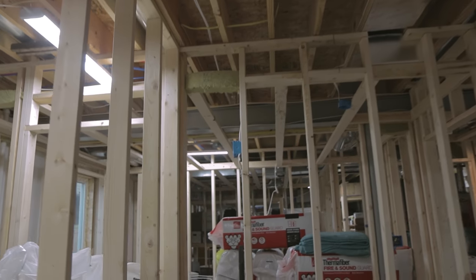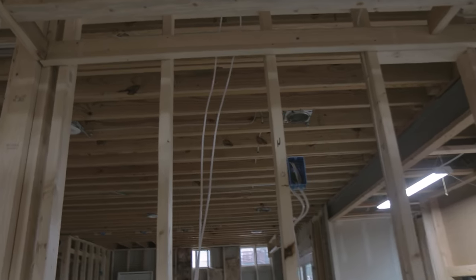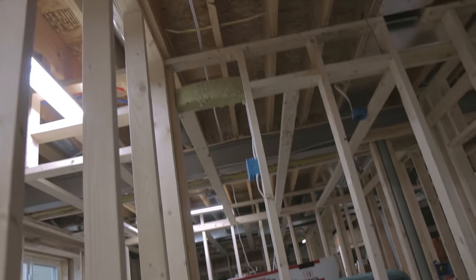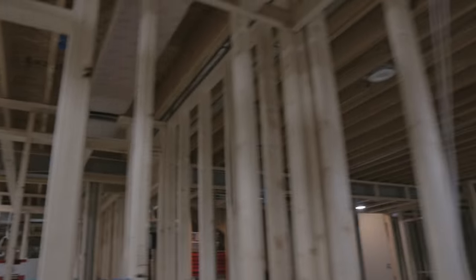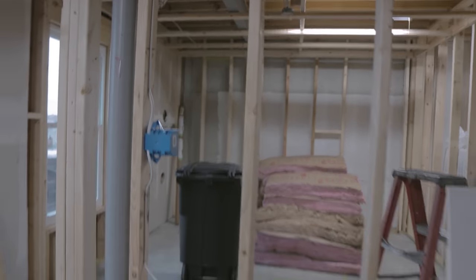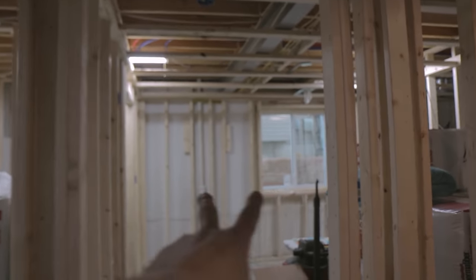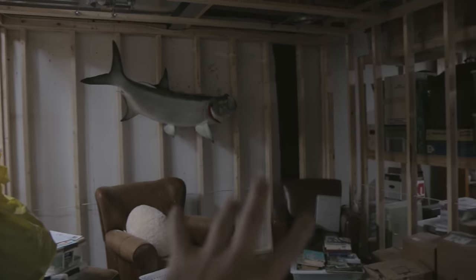I have all of the holes drilled throughout this whole space. I ran two cables in the farthest bedroom — one up here for a TV and one down here for a desk. The cables come down and go up through the joists. I'll be running all the cables through this rafter way and using J-hooks to hold them up. We're going to have two network jacks in this bedroom, two network jacks out here for the TV, then two network jacks in this bedroom, and an access point going right up on the ceiling.